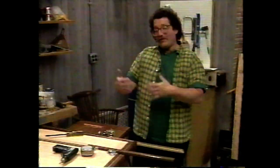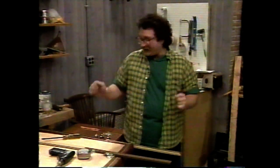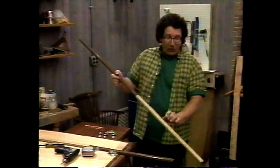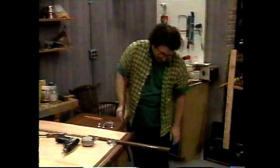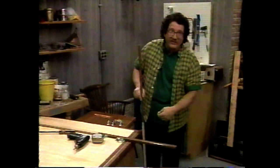The first thing you do is, after you unpack it, you lay the mirror on top of the dresser with a blanket underneath, as I have here. The next thing you do after you take out these things is to measure where this bottom screw hole is going to hit at the very bottom of the back of the dresser. You have a solid rail up top and a solid rail down the bottom. In the middle, if you screw anything in, it's just going to catch your undies.